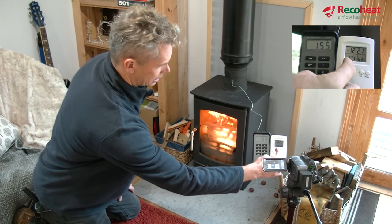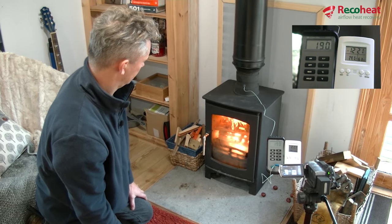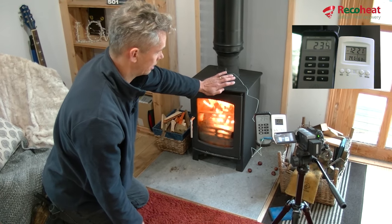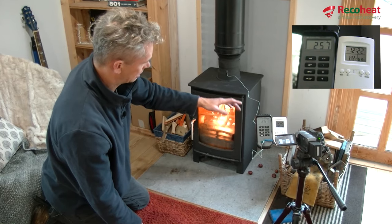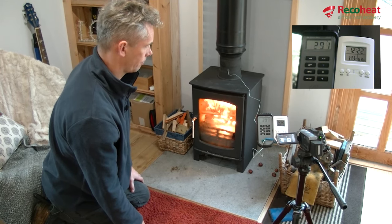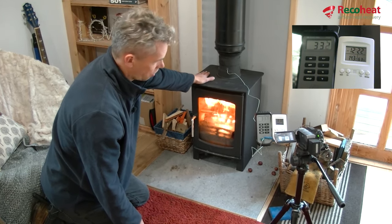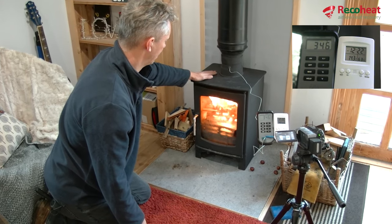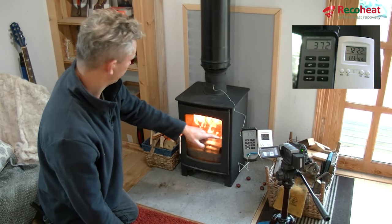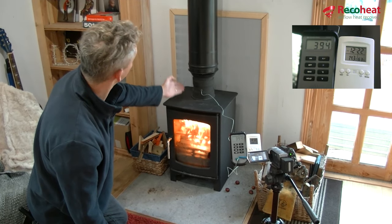The secondary thermometer shows the room temperature is 14 degrees — about a minute has passed. You might notice the hiss coming out of the unit has increased because the volume of air has doubled, as it's now passing 250 degrees. The stove is still absolutely cold externally. What's happening is that at 370 degrees, heat is being recovered from the flue in the sealed unit as it exhausts from the stove.